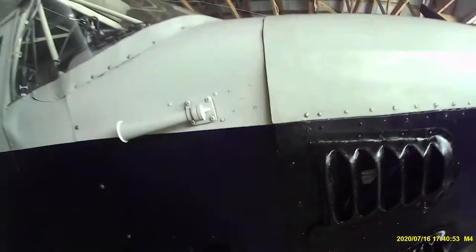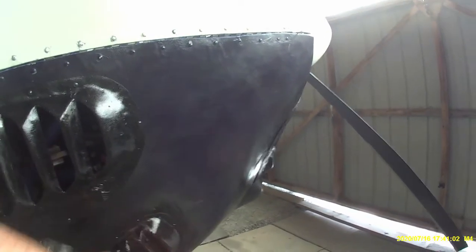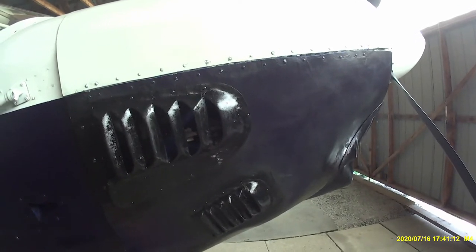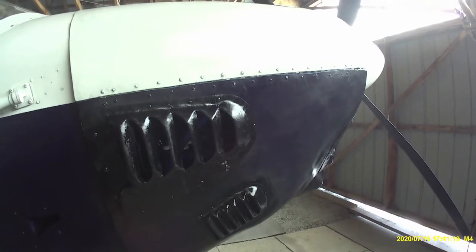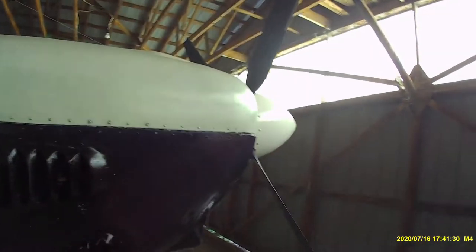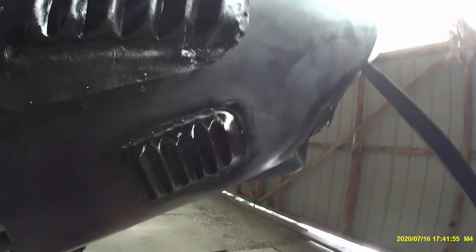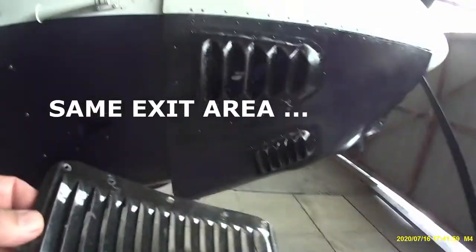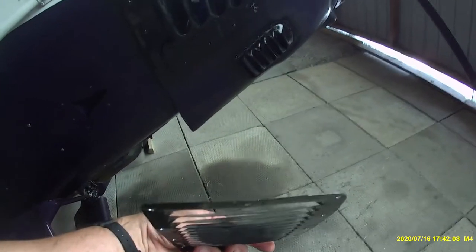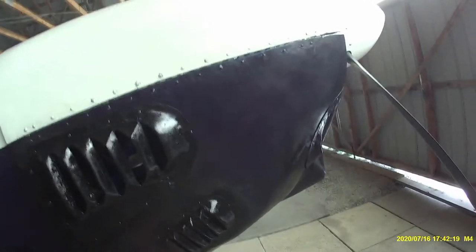I need to put a small cup around there to pick up a little bit more air to optimize those. There was also a very flat louver in this location, which is where the hot air exits from my heater core, acting as a secondary heat exchanger for my water jacket — a square flat surface, very shallow louver type thing that I bought from a hardware store. I replaced that with these louvers here: six outlet louvers, approximately three and a half inches wide by half an inch. I'm getting approximately the same calculated air flow, but I'm not sure how well the old one was working because the depth of those louvers was so small that it may not have been giving me a negative pressure to actually draw air out of the cowlings.